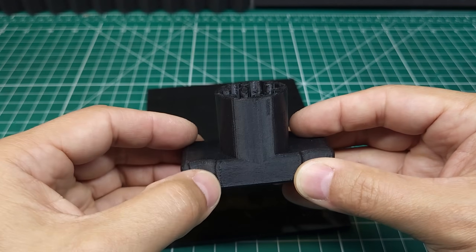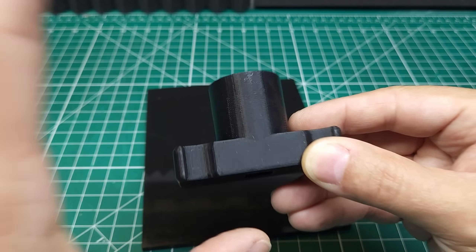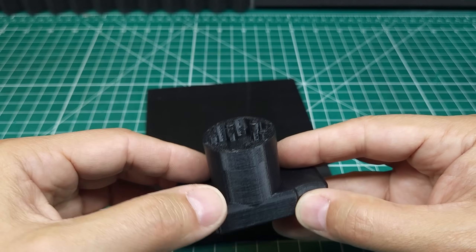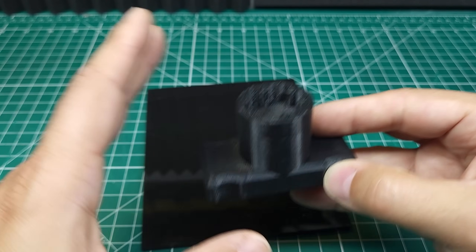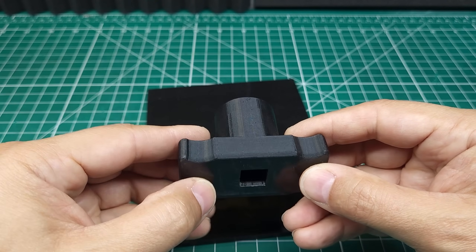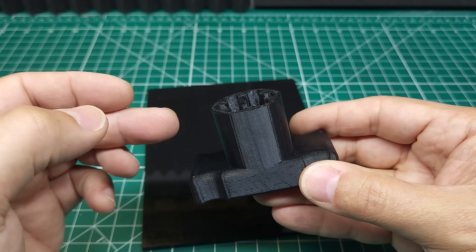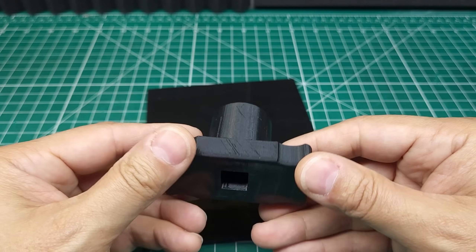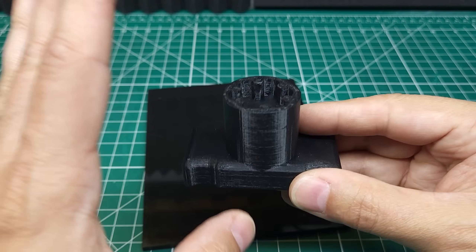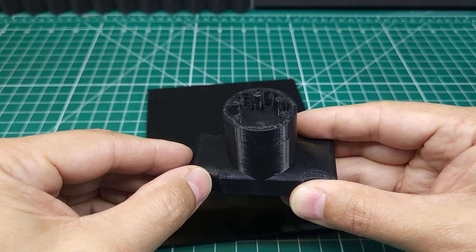There's also a wide variety of materials you can 3D print with, including nylon, polycarbonate, PLA, PETG, and a bunch of other really cool types of materials that have additives in them like carbon fiber. There's even wood and conductive materials — the sky's almost the limit. But as you get more exotic in the materials you're printing, they tend to get more difficult to print and may require your printer to be enclosed. Printing with things like PLA and PETG is fairly simple, and it gets more complicated as you go. There are plenty of resources online about what materials you can use and their limitations.